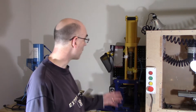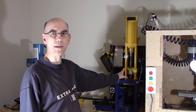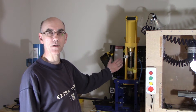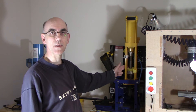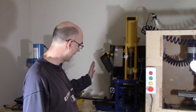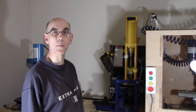What I'm going to do now is set up an air vent on here for exhaust. When this heats up and starts melting the plastic, it creates off-gassing, which is a pretty obnoxious smell from polystyrene. So I like to vent this to the outside so that I don't inhale any of the fumes. I'm going to put the mold in, get the vent hooked up, and then we'll see how the mold works.